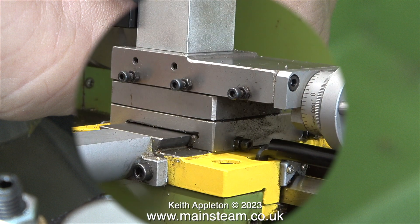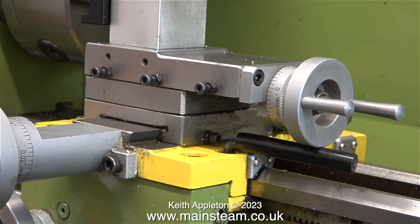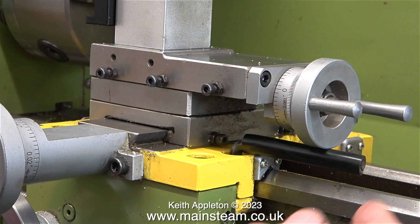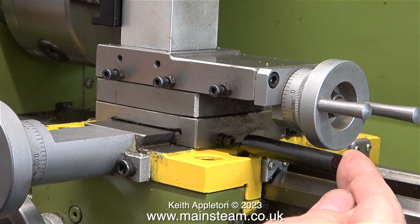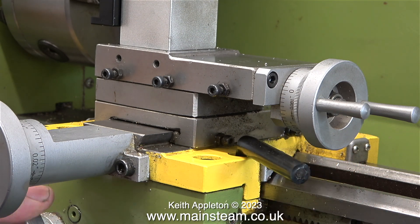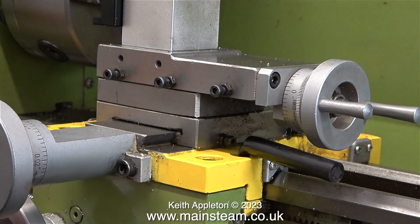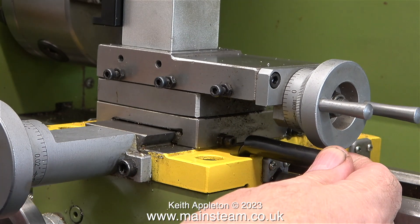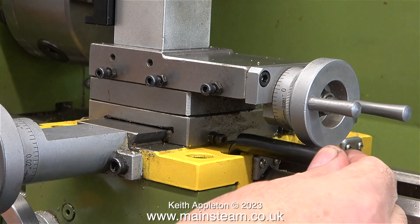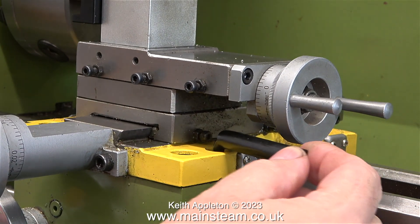All I have to do now is change the colour of the silicone rubber tubing from blue to black. The good thing about this design — and I use the term 'design' lightly — is that when the lever is in the unlocked position, it's right underneath the top slide hand wheel. This does two things: it prevents the Allen key from rocking about in the bolt head, and keeps it in place so it doesn't vibrate loose. When I'm performing long cuts using the auto traverse, it couldn't be better really.